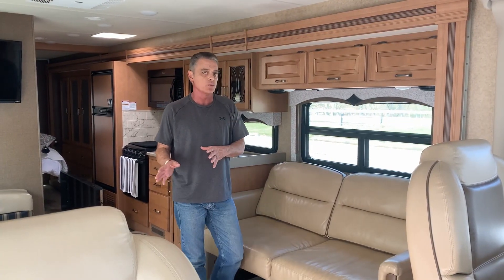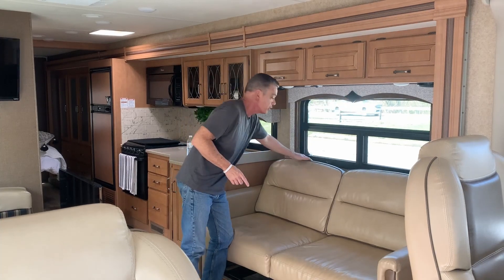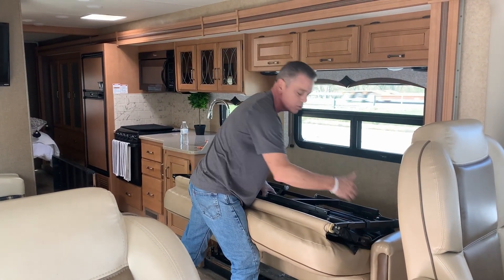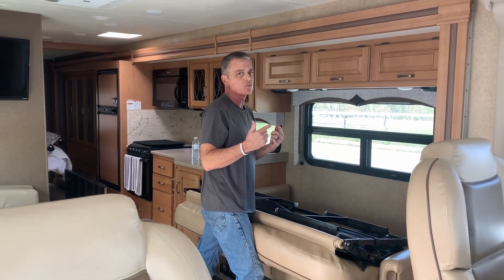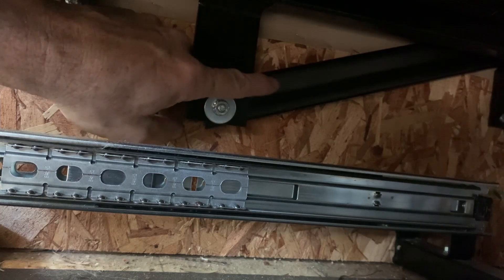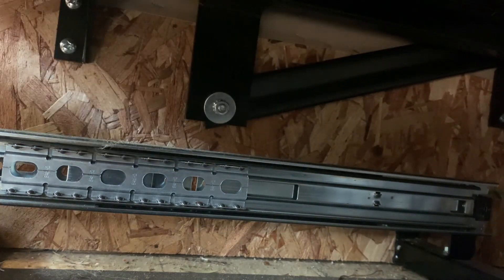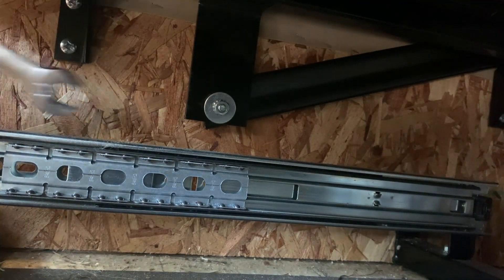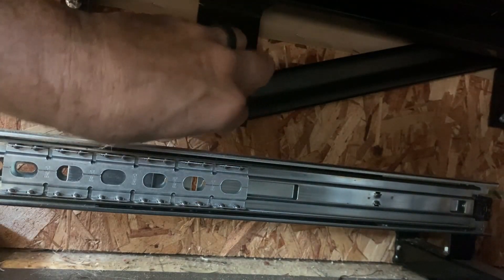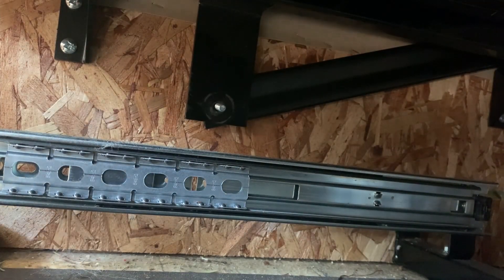In order for us to get this out the door, we have to take this couch apart in pieces — you can't just take it out in one piece, it just won't fit. The first thing we're going to do is deal with some arms over here that allow this to fold forward. These arms are through-bolted underneath the couch. We're going to take those through-bolts out and we should be able to take this piece out in one piece. We have two arms that come down, one on each side. This arm is connected and through-bolted to a plate attached to the frame, and the other end of the arm is attached to the upper section of the couch. So all we have to do is take these off. Take this through-bolt out, take the one out on the other side, and we should be able to lift that out.